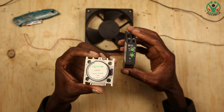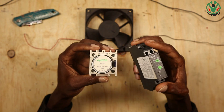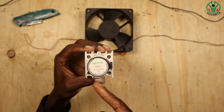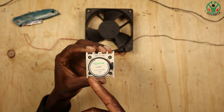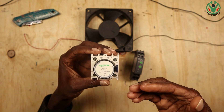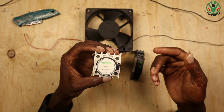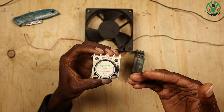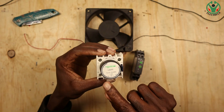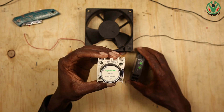In terms of functions, this mechanical timer only does closing and opening contacts. The electronic timer has a wide range of functions. This one has a range of one to thirty seconds, but depending on your time need you can get different time scales — for example, one minute to thirty minutes. It depends really on what kind of time scale you want.